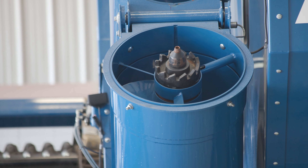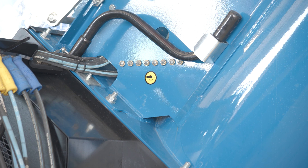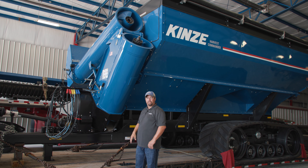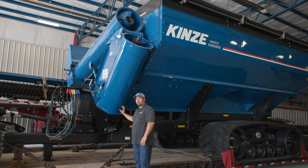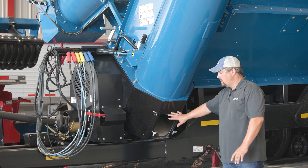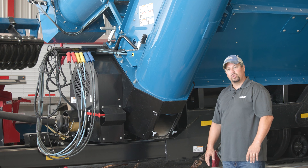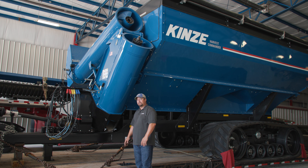One of the next things you'll see: we've added our hanger bearing in the center of that lower vertical, which has been a problem to climb up and grease, and it's now added to our grease bank. You'll see one other greaser, and up above we've got a tube that comes in and feeds that backside from what we call the helicopter — that mounting piece that hangs it. Both of these features, although in different locations, on our dual auger carts will have that same feature set. The same type of slide gate on that front axle, or right behind the front hitch on our corner dual auger carts, will have the same slide gate action. We also have the same upper or lower vertical center bearing that'll be greased through the grease bank as well.